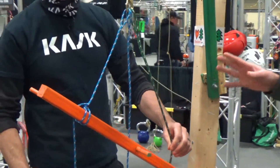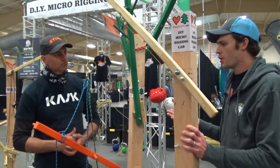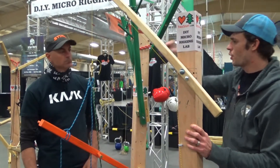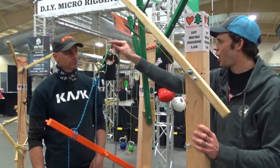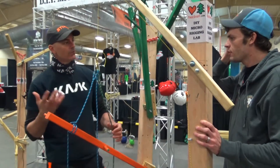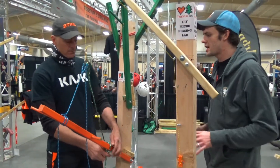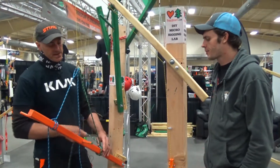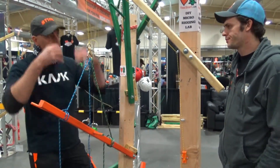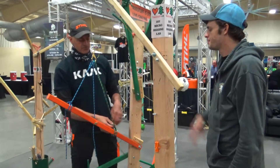What immediately appeals to me, Mark, is the hook's not coming down — the hook's not in your face. When I did crane work, I was always getting hit in the head with the ball, especially on windy days — the slings would get caught up and the whole thing would drop three feet. The weight of that ball can be 350 pounds or more. With this system, nothing leaves the hook. That's the immediate appeal. And on the same note, it's the same safety factor for the ground crew. When this piece hits the ground, the hook doesn't get down where the guys are trying to unhook while it's swinging around — they can just untie the knot and pull it all out, then pull the slings back up to you.